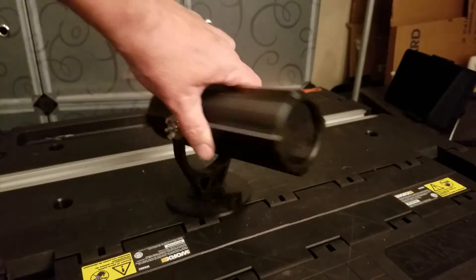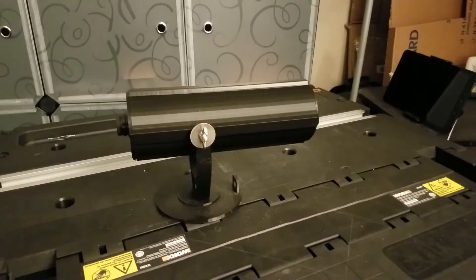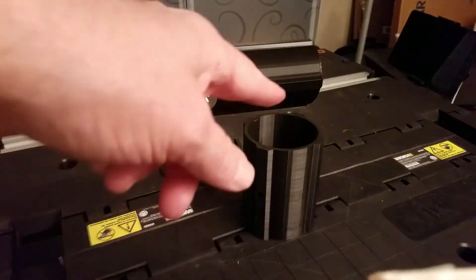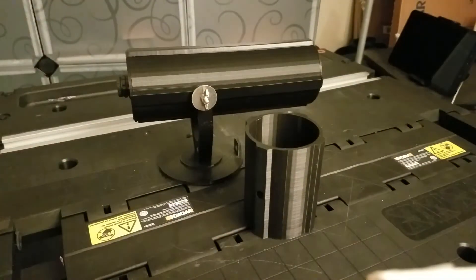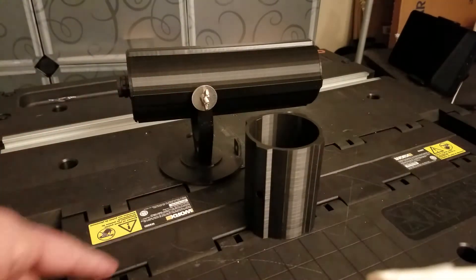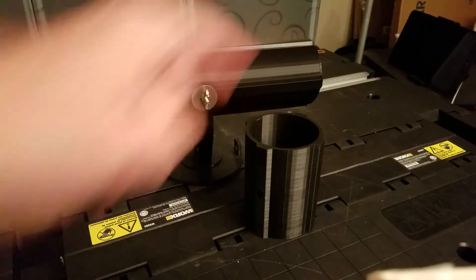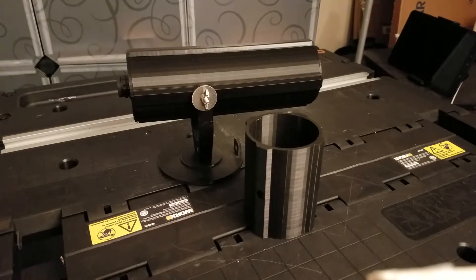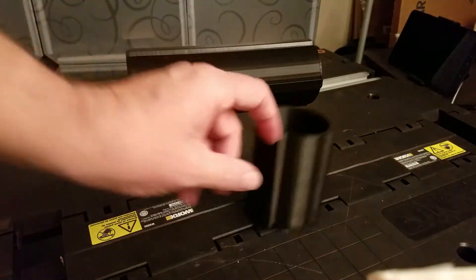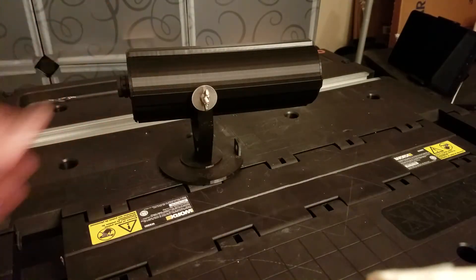When I was putting this together with a flashlight, the focus had to be at least this long. It originally comes with a shorter barrel. This wasn't enough to get a sharp Batman symbol — it was more muted because the light wasn't focused enough. So what I did was go into my slicer and increase the Z, but not the X and Y. I didn't make it proportional — I doubled the Z but kept the X and Y the same. That gave me a nice long barrel about twice the original length without having to worry about it being too big to fit the hardware.